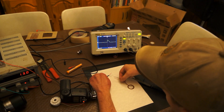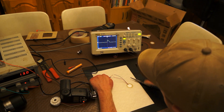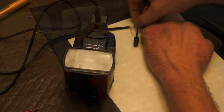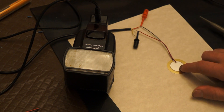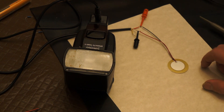You might be thinking: great, that's 30 volts — all I have to do is connect it to the flash, tap it, and it'll fire the flash. Well, yes and no. The problem is it works on such a low current that it just can't provide enough to fire the flash, unless you belt the living crap out of it, which isn't that useful.